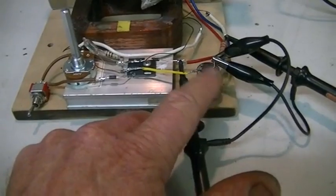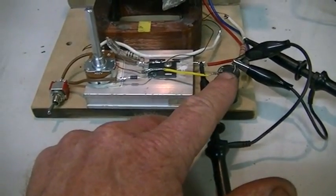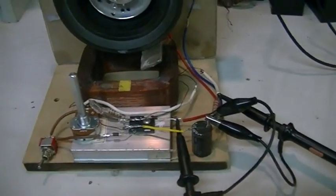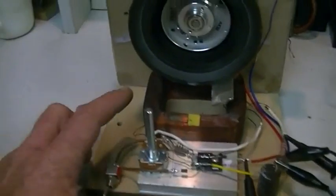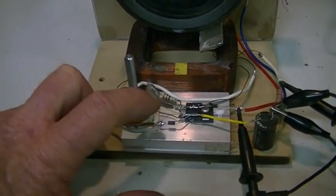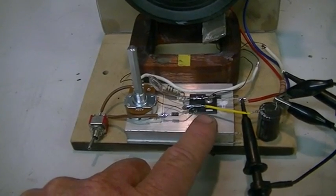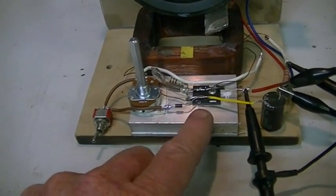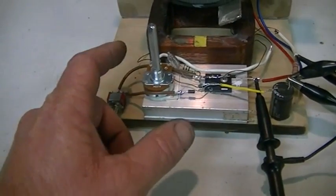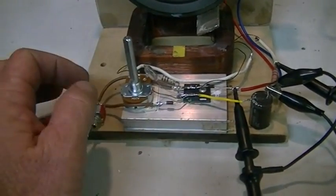That is because we're running on a very low voltage. The pulse motor and the self-oscillator will run down to a voltage of about 0.5 volts, and the self-oscillator will keep running until the cap drops to 0.2 volts. That is due to the many turns on our trigger coil — we still have enough voltage there to fire the transistor. The TIP3055 needs about 0.7 volts to fire, and we're using a high-turn coil to increase the voltage when the run coil has a very low voltage input.